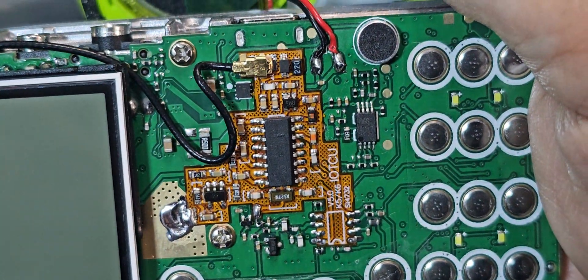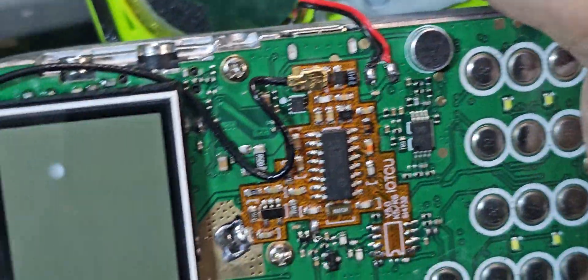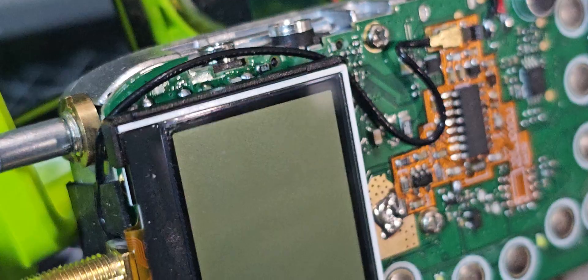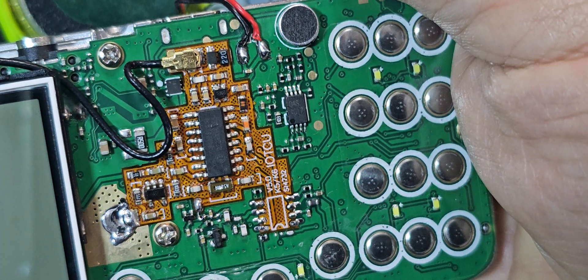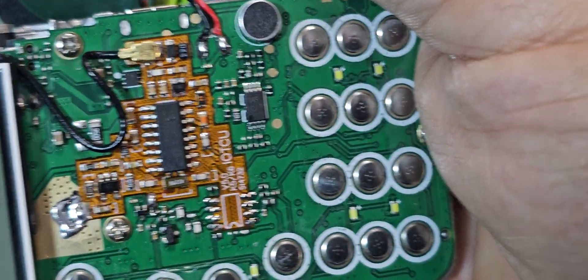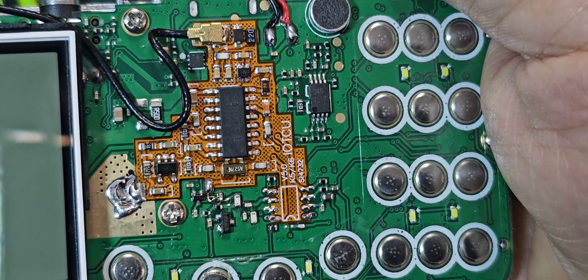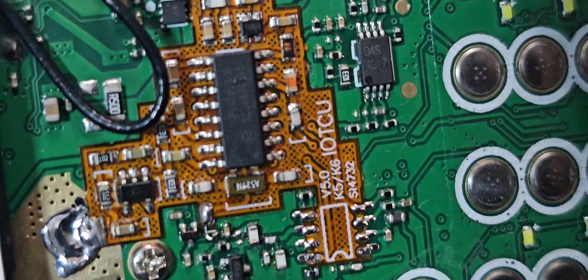I can actually see better this way. There's an extra connector just on the actual board which is running up to the antenna. It's a bit wobbly, but it's there and it is working. There's a big solder joint here. On the other one, they removed one of the diodes in this area to allow that antenna to be connected — that's what we're seeing. Now the upgraded chip — where's that? It could be this one here that gives it the extra memory.